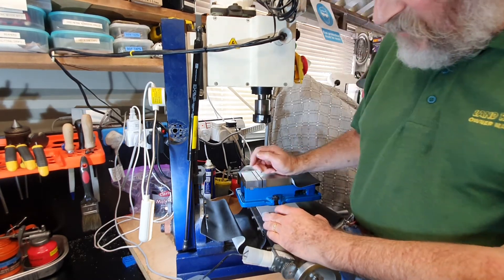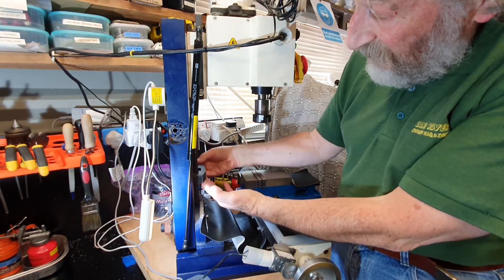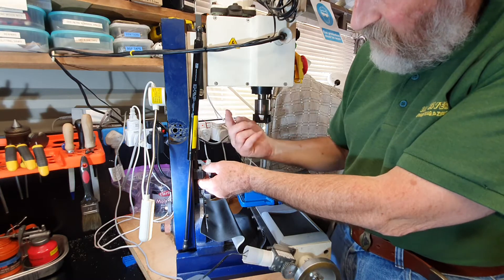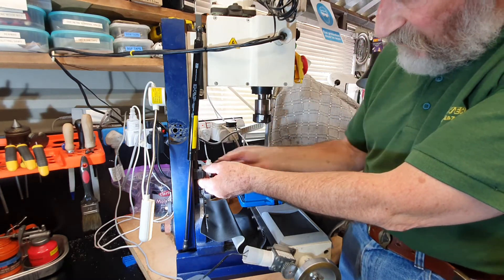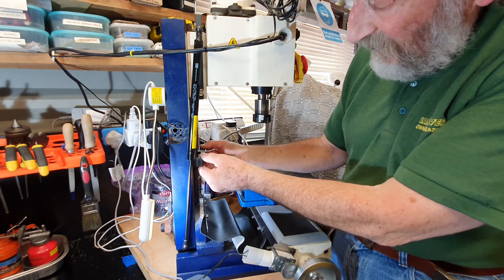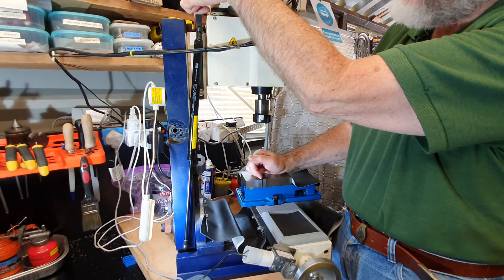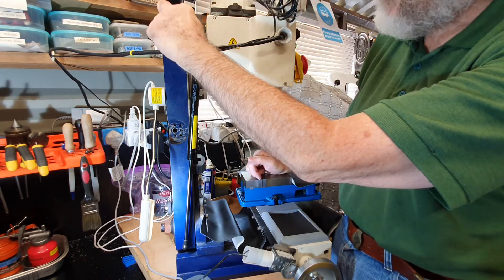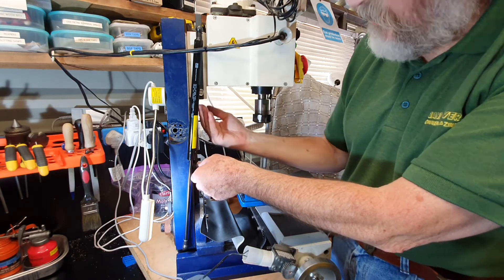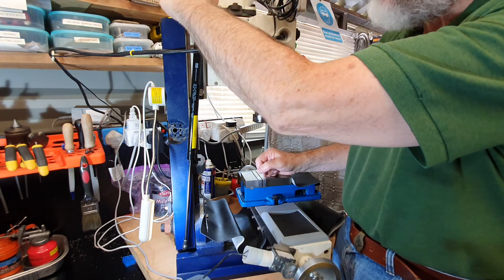Some warnings when preparing to remove the torsion bar: on here you have a bottom stop position which can be raised up and down — bring this right below the head of the mill. Don't rely solely on the lock that locks onto the gibs on the opposite side of the head, just in case the head came crashing down while not held by the spring mechanism. I also removed the bump stop at the top so I could raise the head to the very top for maximum movement, then readjusted the stop right up underneath the head. Once the gas strut was fitted, I dropped the head down and refitted the bump stop at the top.